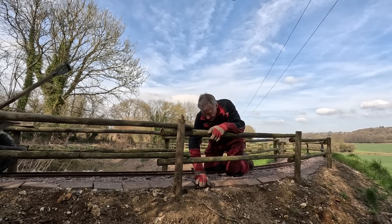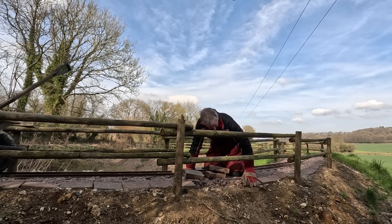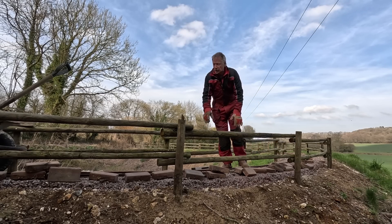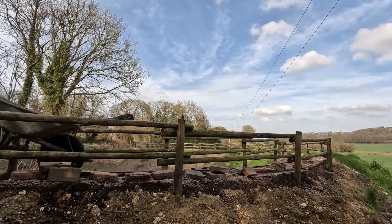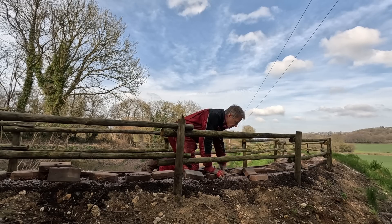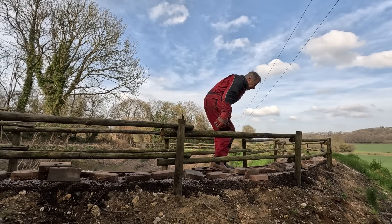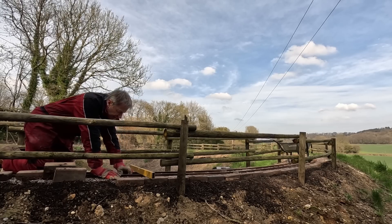The first thing to do is to lift the line of bricks and put some soil underneath and lift them back up again. I've got some soil with ballast stones in it that I dug out from one of the points when I was doing that up last year, so I'm going to put that in the trench and build it up a bit. I'll first try to set a brick in the centre at the height it needs to get to, sight along to see if it looks right, then work out from that reference brick. Bringing the bricks closer to the rail also gives me a bit more soil on the outside to support them — this is a slightly better line for the bricks.